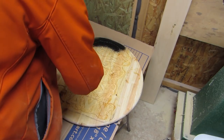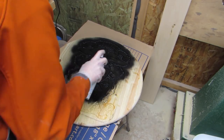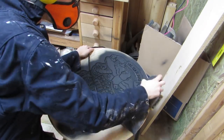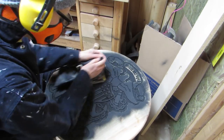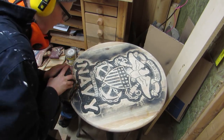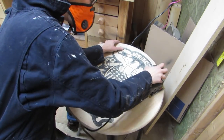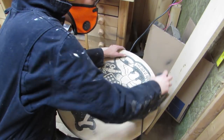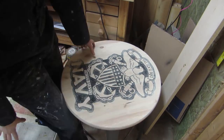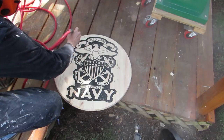After that dried I painted everything black with the primer and I think I did this just a little too thick. While I was sanding this off it gummed up on the sanding paper quite a bit and I had to change a whole bunch of papers out. I think it was because of the shellac being too thick, and it also could have been from the black primer that I sprayed on way too thick. But I finally got it all sanded off. Then I took it outside and sprayed off the dust with the air again.